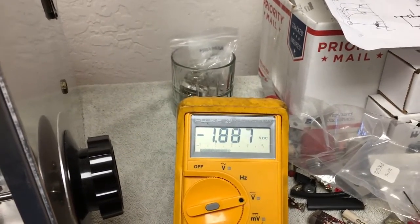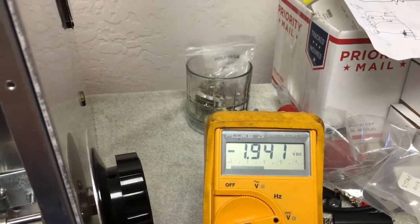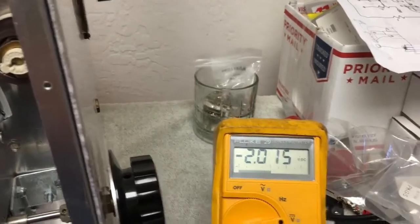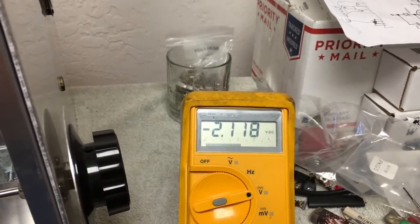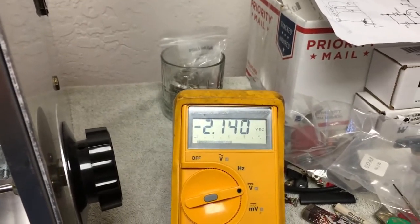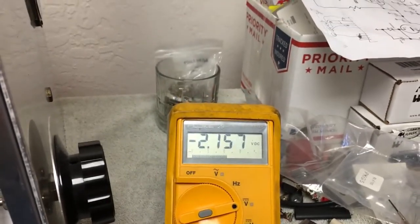It's just dropping down to where it was without the voltage on it. If I go over to the 4400 grid it'll be the same — it's creeping back down again to like minus 1.9, minus 2 volts, something like that. It's the actual tube that's moving around. Once it has the plate supply voltage on everything, it'll stabilize with the screen voltage on it. It'll probably quit moving around as much. There's a good chance the regulation will stay put, but I'm not 100% positive yet.